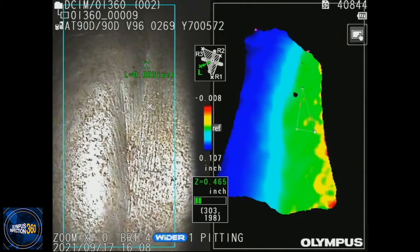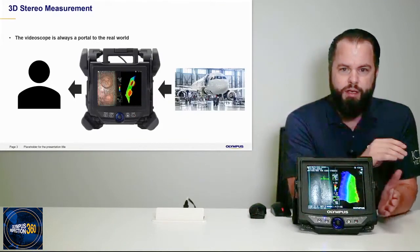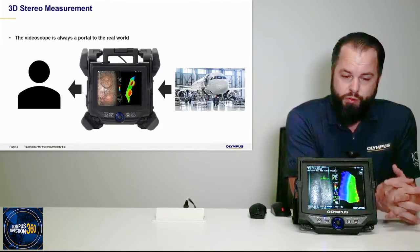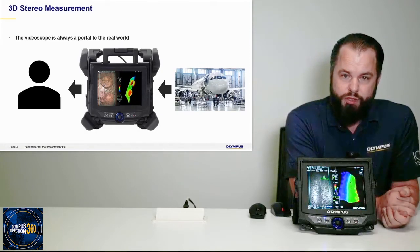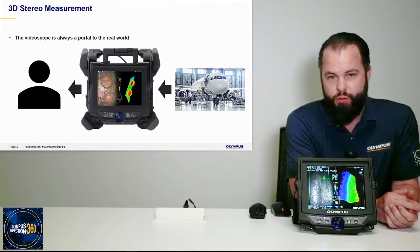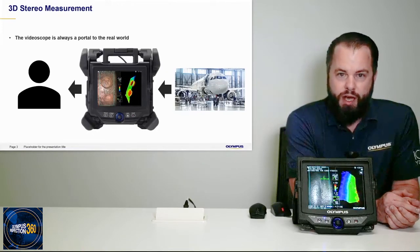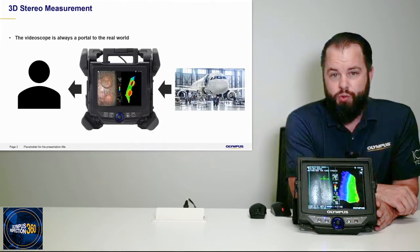We just went over briefly how 3D modeling can help with turbine blade inspection and to help quickly assess whether or not you have undercutting on your weld. These are just two very specific and common examples in the RVI world, but they demonstrate how 3D modeling can improve more complicated and sophisticated measurements, and actually create situations where you may have to re-evaluate which points you are using and the methods by which you measure. Not just with the extra added precision of the NX — being able to choose a better point means you will have even more precision on your measurements than without 3D modeling.